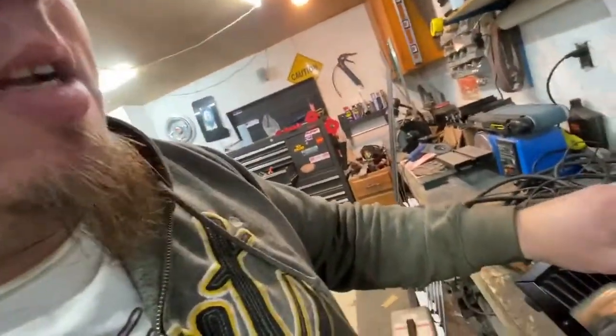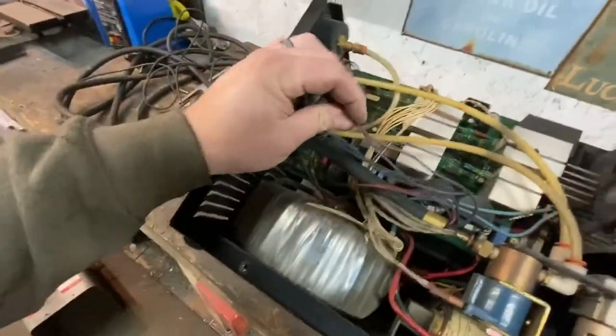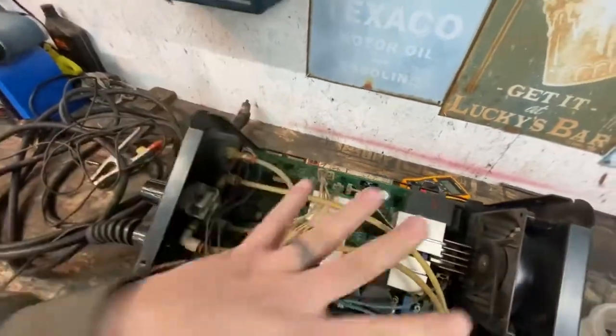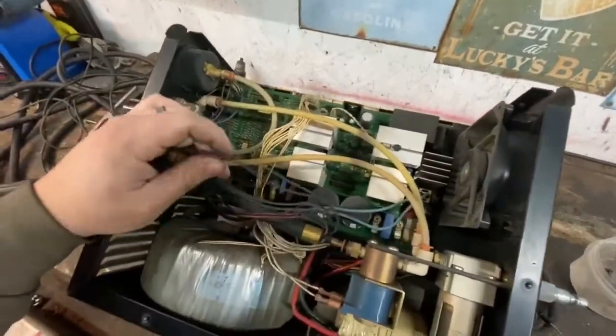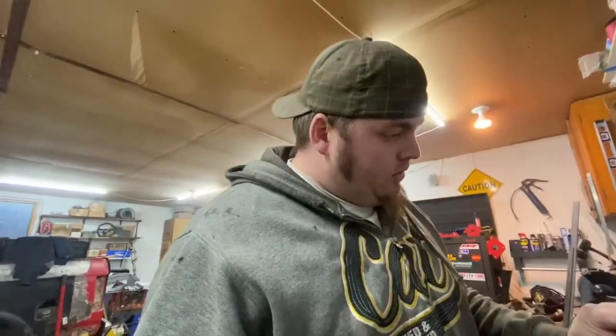So I'm going to dig into this and see what I can find. I found out these two purple ones, and I found that just using my really cheap digital multimeter — probing these two wires at the plug at the top. By pushing the switch, I was able to decipher that those were the wires I need for my trigger, because when I hit that button, my multimeter beeped and showed continuity. So I'm going to tap into these two for our switch. Then I've got to figure out a place to mount a plug — oh yeah, I need to order plugs too.